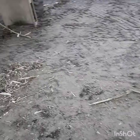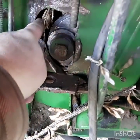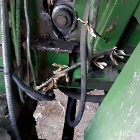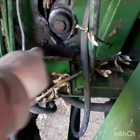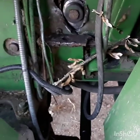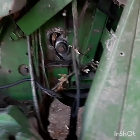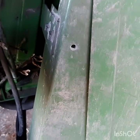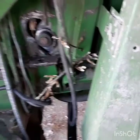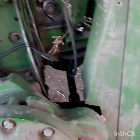While I was in the yard I was noticing some symptoms in the field, which brought me over here. This is supposed to be up here and there's supposed to be a little bolt and adjuster system — this is a bar for the concave. The other side is fixed; this side was supposed to be adjustable. I put in a heavier plate because the factory just had a little eighth-inch strap, and over the years it started to get pounded down. Yeah, it broke that little bolt and plate out of there, so I'll have to come in here, lift this up, and cut and trim this metal away.